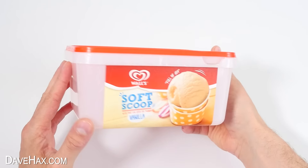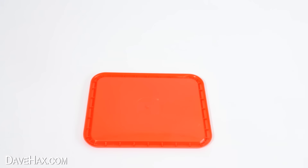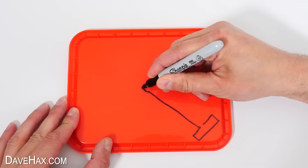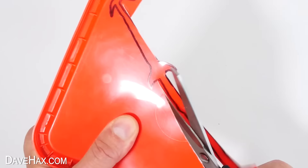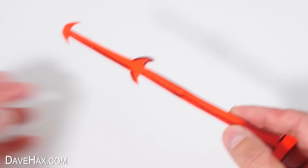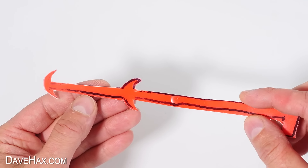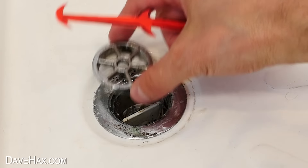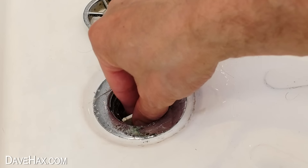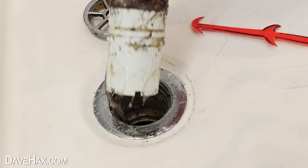Before we look at the other products, I want to show you a really cool life hack you can do to clean your drains. Take a flat piece of plastic — the lid from an ice cream tub is ideal — and draw out a shape something along these lines. It doesn't need to be precise. Cut it out with a pair of scissors. The important thing is that there's a decent hook at the bottom and that the whole thing's flexible. Now, if you find your shower isn't draining properly, remove the grid. If yours is a bit stuck, you may need something a little bit stronger to lift it with. Then lift out the dip tube.